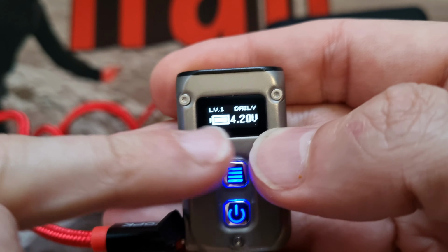It's fine. Bear in mind, sunlight is 100%, and the high-end, good color rendering index Nichias and things like that, you will get around 90 plus, which looks much better. If you're a color snob, you'll love that. If you're not, if it's just a keychain light and you don't sit around wondering about color rendering index, you can ignore what I'm saying here. But for those who do want to know that, it's about 70%, so it's okay. But obviously there are better options, which I'll show you in a moment, and you will get better color index. In other words, you will see more of the color gamut coming back to the human eye there.